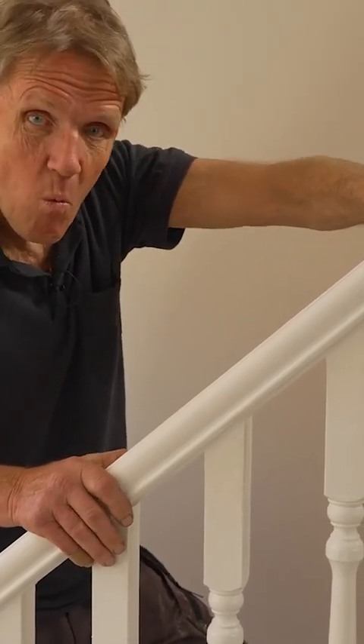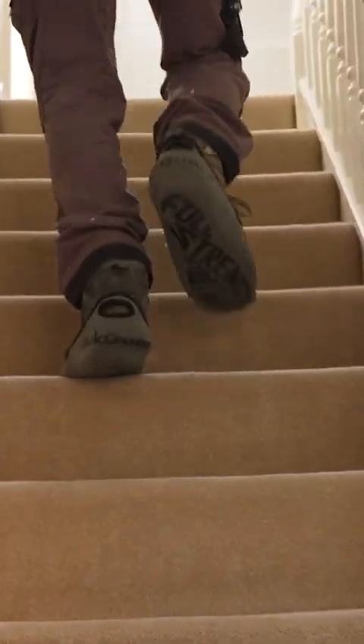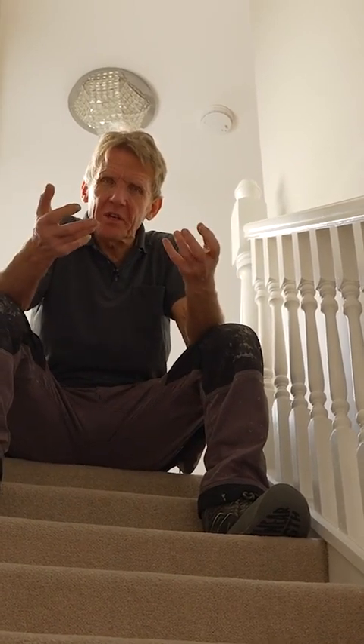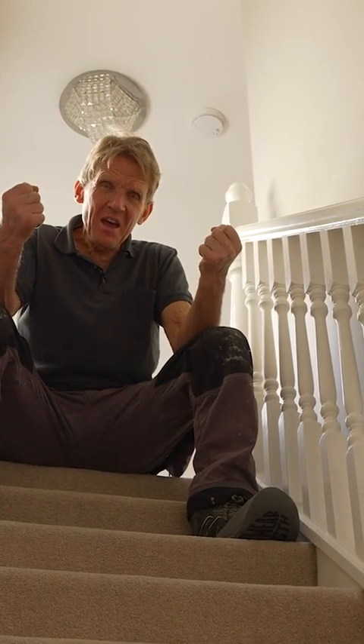The first thing I've got to do is find out where it creaks. It's a pretty common thing, creaking staircases, and normally I would say they're creaking because they've dried out. This house is just over 20 years old and things have dried out. They've got central heating, so best way in the world - when you build a staircase it's fine, and then slowly but surely it shrinks.